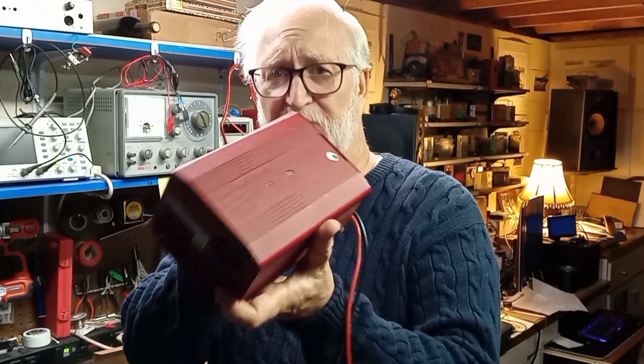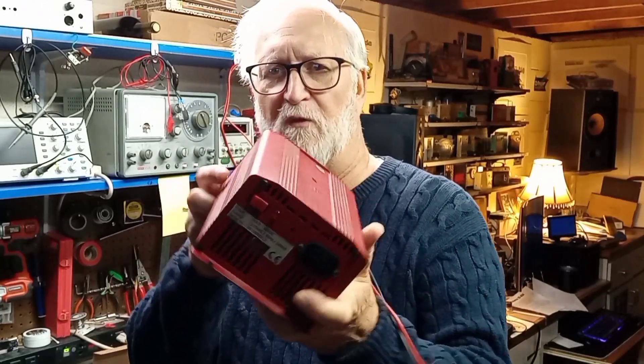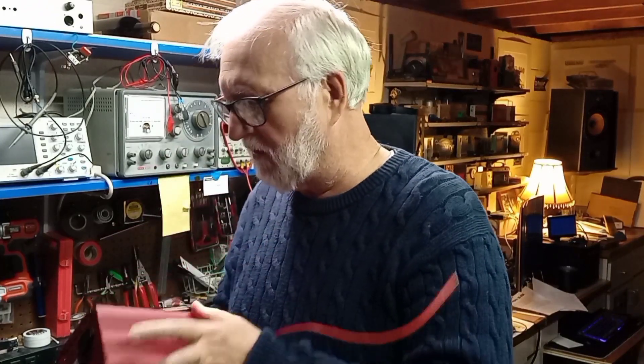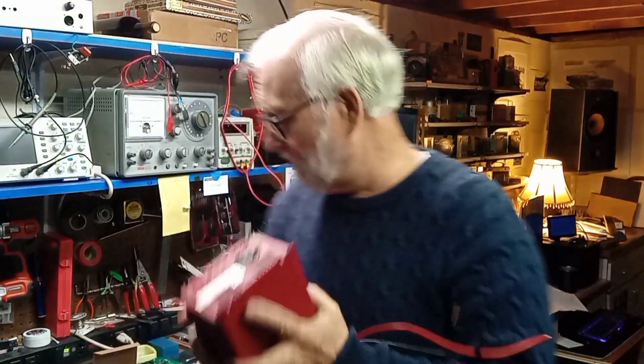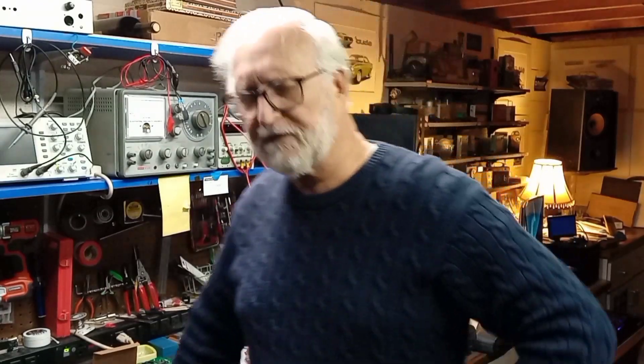This thing's heavy, man. It's got a big toroidal transformer in it and it's a pure sine inverter. Of course it won't fit inside that box — though I could mount it on the side, but it's heavy with a nice heavy aluminum case, so it certainly won't fit inside. I do have a smaller 150-watt, but it's one of those modified sine, which is basically just a square wave. Those are okay, but some electronic equipment doesn't like it.